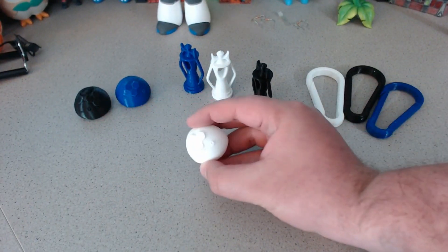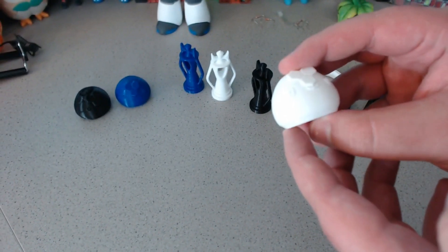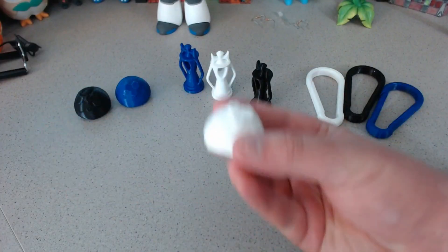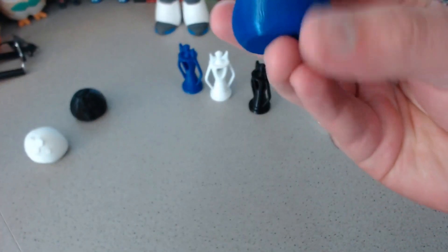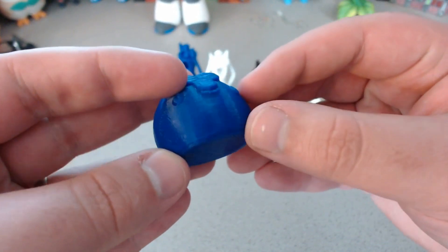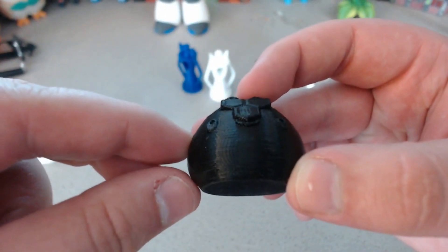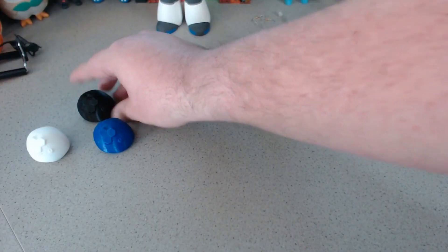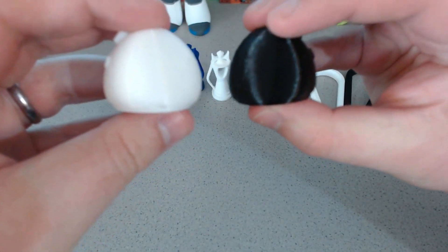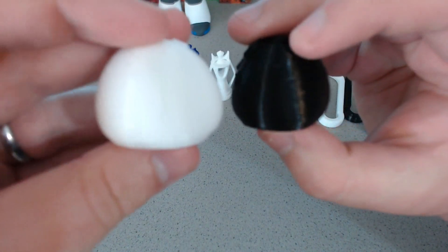First, let's talk about these slimes. I printed these because they have a little bit too much of an overhang along the bottom. As you can see, there's a little ring around the bottom and a little indentation on the normal Hatchbox PLA. The PETG didn't hardly suffer from this at all — just a little bit, so noticeably less than the normal PLA. The PLA Plus suffered from the same problem, so I would rate that at exactly the same as the normal PLA. The layer lines are pretty much not visible on each of these printed at 0.3 millimeter layer height — really no difference in quality.